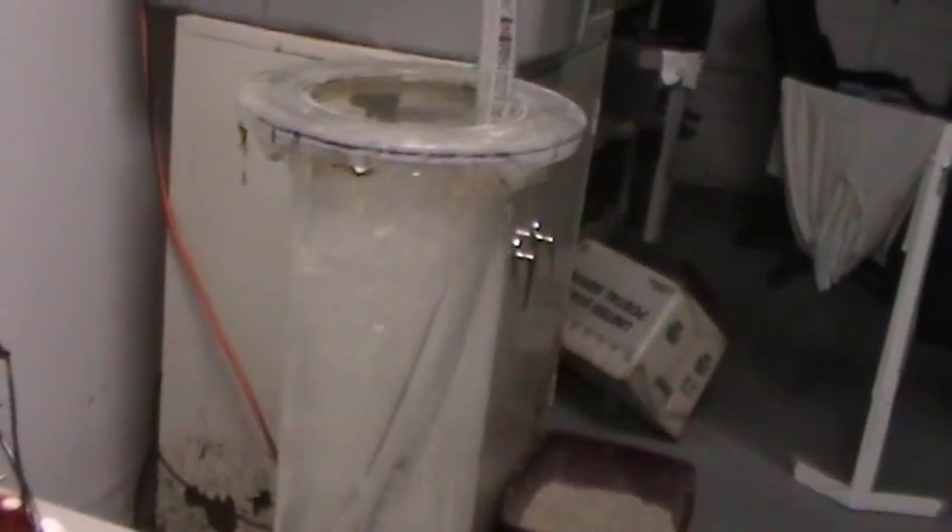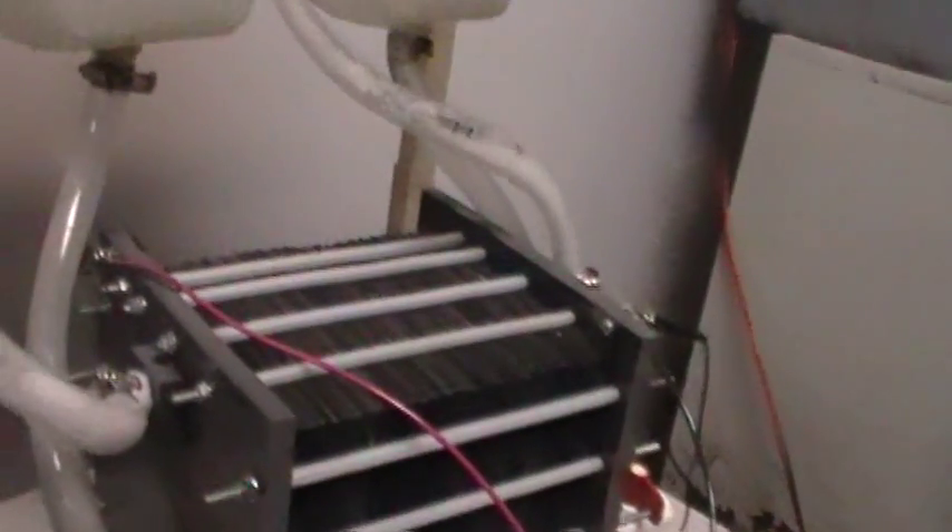There it goes — the 118 plate cell. It's a little bit different than Steve's: a little bigger openings in the plates, five-eighths inch as opposed to three-eighths inch in Steve's. Also larger tubing so the gas can move out quicker.